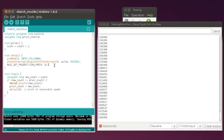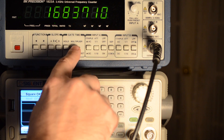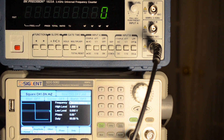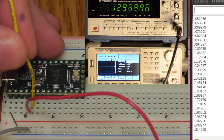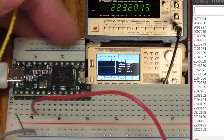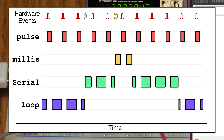Let's give that a try. With this code in there, we'll upload again to the board, come over here and set the frequency counter to zero. We're at 600 kHz again. Let's do another quick test — and we see that the numbers matched. This allows much, much better counting, all by just having the interrupt priority set correctly.